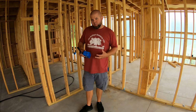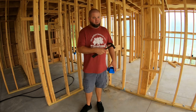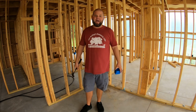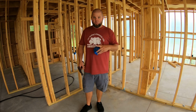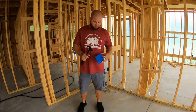So I'm never supposed to exceed 80% of 20 amps. Now, while wiring something like a bedroom in a closet, I'll never get anywhere near that. So according to everything I'm reading, I can put as many outlets on a run of line as I want to, because it's all about amperage and intended use, not number of outlets. Thought that was kind of cool. Glad to hear that, because I was thinking every 6 outlets had to run a new line.